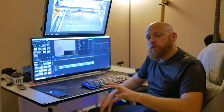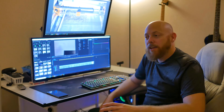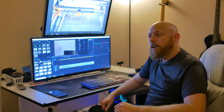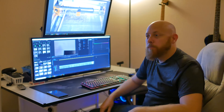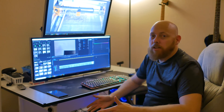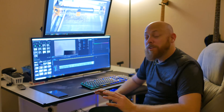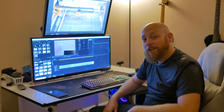I ended up taking those external motor controllers out of the equation and using the onboard motor controllers of the MKS board, which are pretty decent. That got a much better result — there was still a delay, about 0.7 milliseconds, roughly a tenth of before — but that worked out to about half a millimeter of separation between the two images, and that was still unacceptable to me. So we went down a really long rabbit hole, and we did figure it out.